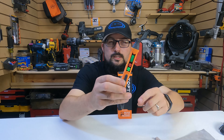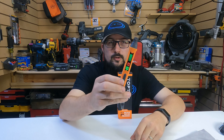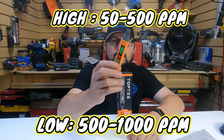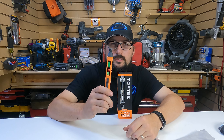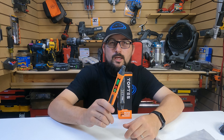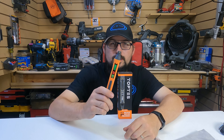After you turn this on, this thing's gonna beep twice. There's two beeps — that means it's been 30 seconds and we can now enter low sensitivity mode. You hit this button and you enter low sensitivity mode. The difference would be in high sensitivity mode when the tool is first turned on, it's gonna get a reading within five seconds. In low sensitivity, it only takes two seconds. I recommend if you're gonna use this to test gas, that you always use it in low sensitivity mode for the best results.